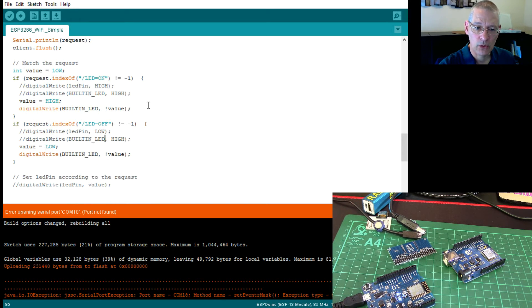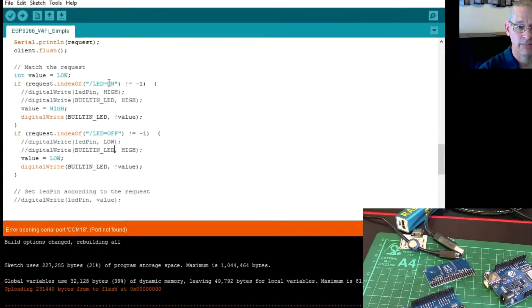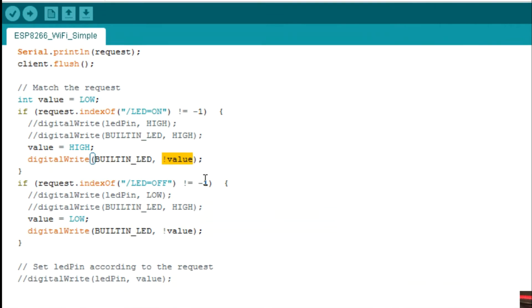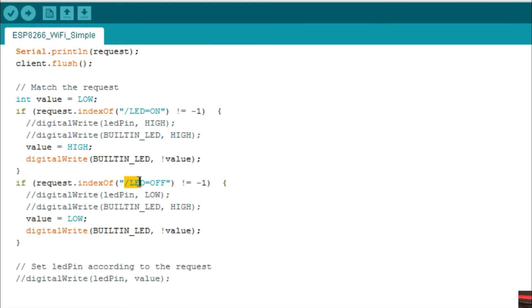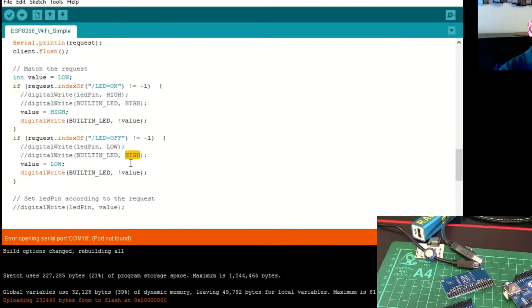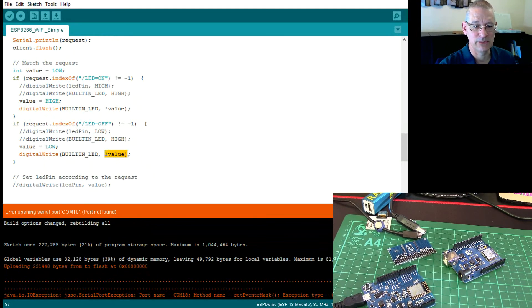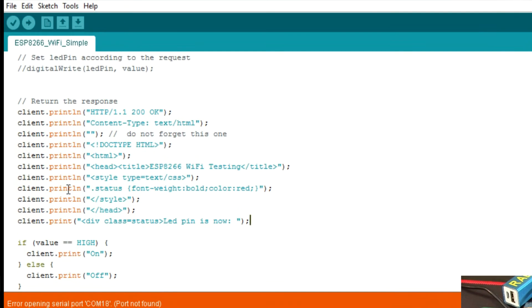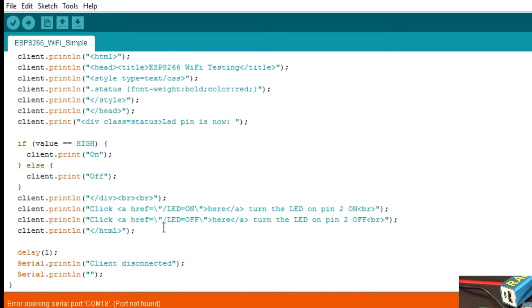Just a word of warning: all ESP boards have a reverse output on the built-in LED. When we want the LED on we say Low, and Off we say High - because High is off and Low is on. In the code I'm setting it to whatever value it isn't currently set to. To serve up that page with just a couple of lines - this is what the HTML looks like. You do need that blank line after the header. The anchor tag 'a' is the clickable link; perhaps we'll go into some HTML programming a little bit later.